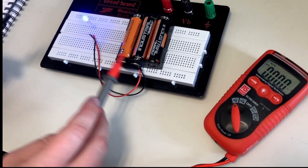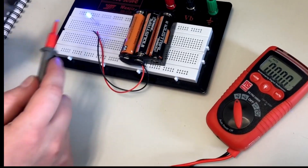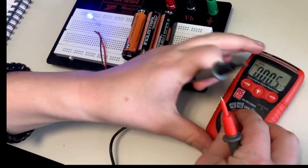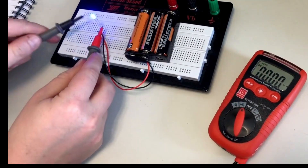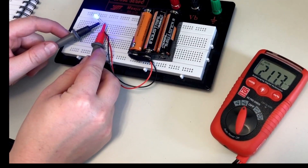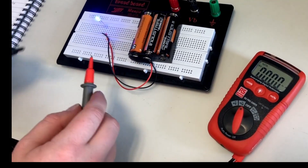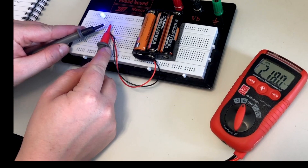We've set up a small circuit with a cell and an LED and we can measure the current around it. If I'm overloading the circuit it'll tell me and I can change it to milliamps. Just be careful when measuring current that the multimeter becomes part of the circuit and there is a chance that you could short it, so that's a safety issue.